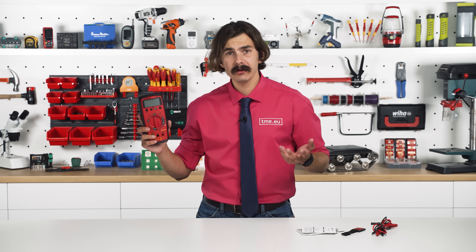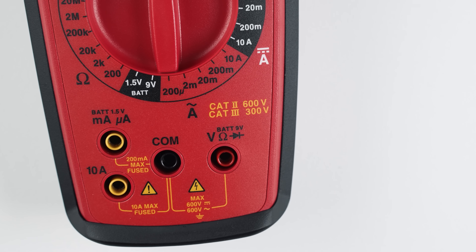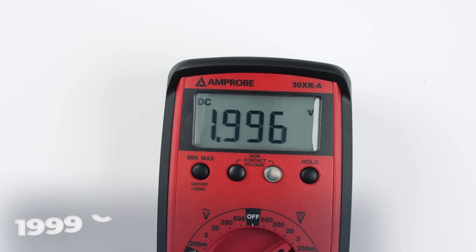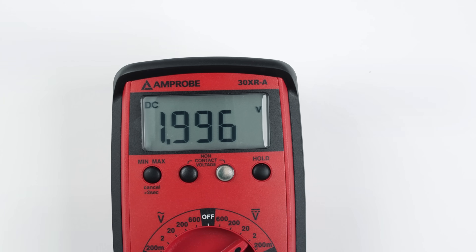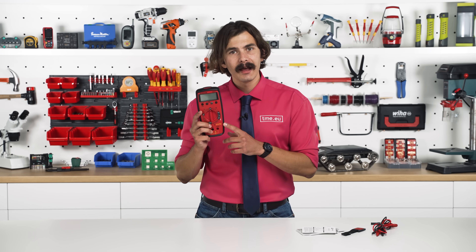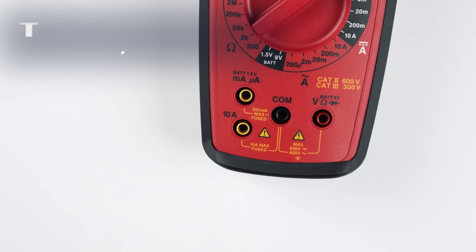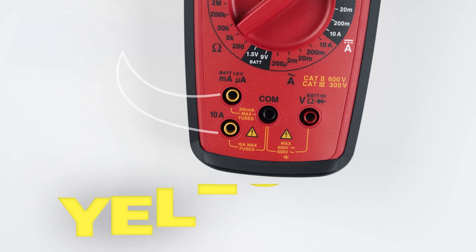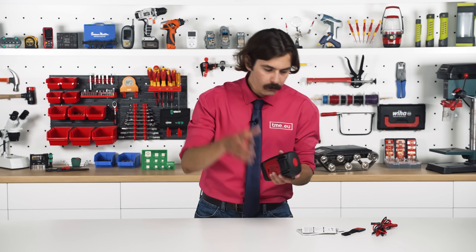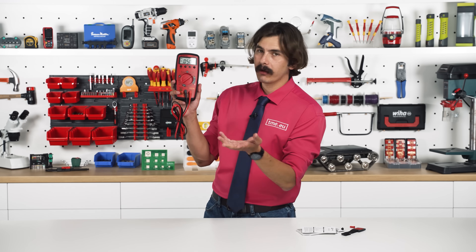As mentioned, this one is for professionals like HVAC technicians and residential electricians. It is rated 300V CAT III and 600V CAT II. On the top we have a 3.5-digit, 1999-count display, three function buttons, and an LED indicator for non-contact voltage detection. In the middle, a large red dial. At the bottom we have the terminals — unlike most meters, the current terminals here are in yellow, not red, so you're less likely to connect the probes to the wrong input.